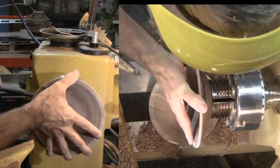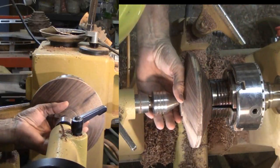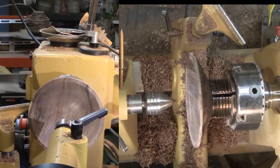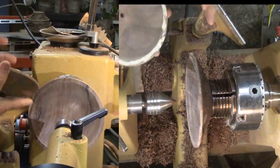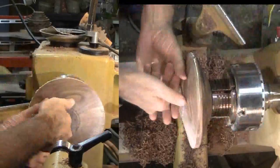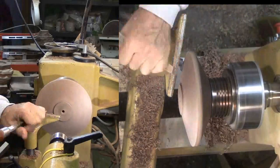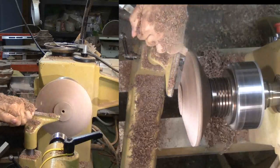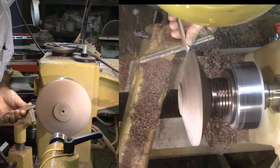Now I'm switching back to mount the bottom because I need the top towards the tail stock. I've also put a 60-degree cone on my tail stock to help align the two halves. Then I'll glue the two halves together, taking care to align the grain as best I can. Some wood has been lost so there are some compromises. After allowing time for the glue to dry, I'll finish up the exterior. I'll stick to using my skew as a scraper — the walls are thin and I don't have a lot of room for error.